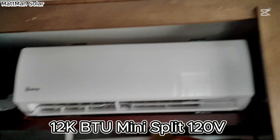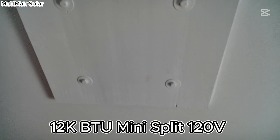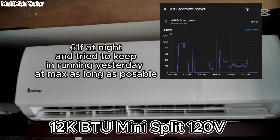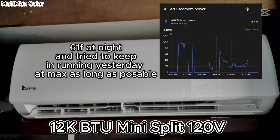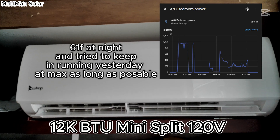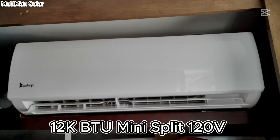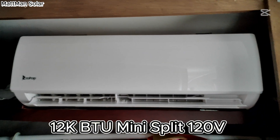Same here as in the other room. I originally had one of those window units mounted in the roof that makes a ton of noise. Not only that, it consumed about 25 kilowatt-hours of power a day just running — and during the summer here in Florida, it usually couldn't keep up. It was noisy and a power hog. These new units run — if you turn them on full blast, 70 degrees inside while it's boiling outside — about 5 or 6 kilowatt-hours a day each. Even both of them together is half of what the old one used, which is 25% of the old power usage. Very rarely do you need that much power to keep things cool — it can be 100 degrees outside and these can easily keep up.